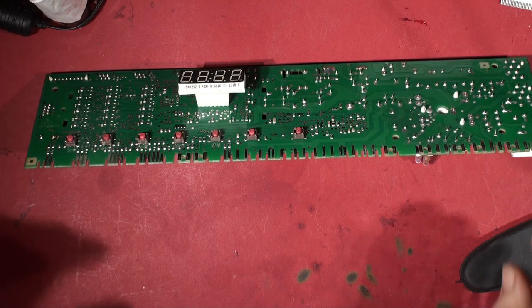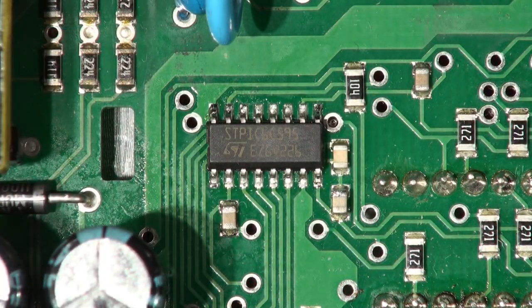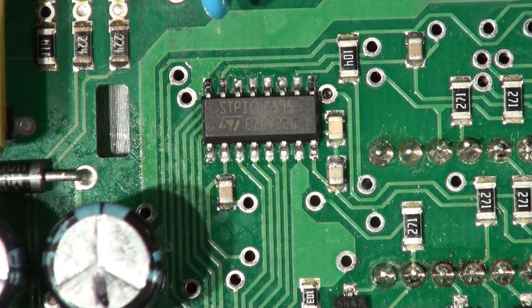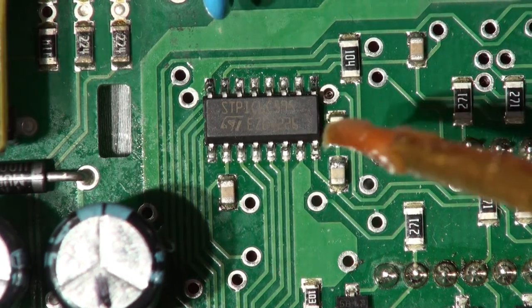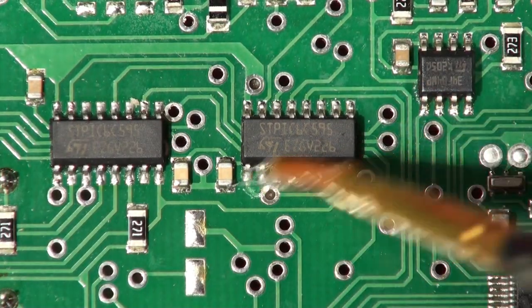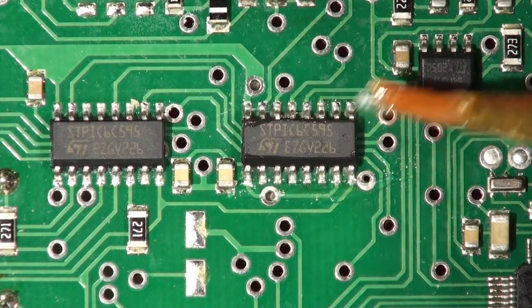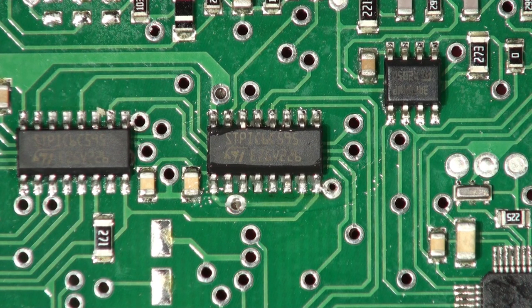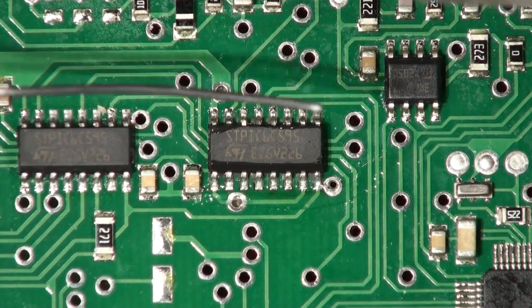Display, shift registers, or micro? I've dug some out of the drawer — I've got a tube of about 50 of these chips, exactly the same ones. I'm going to change them. I'll do two with the hot air gun and one with the soldering iron, just to show you how it's done. If you don't have a hot air gun, this is the way to solder chips. Put some flux on, noting where pin one goes — 400 degrees, decent iron.